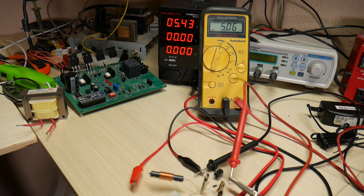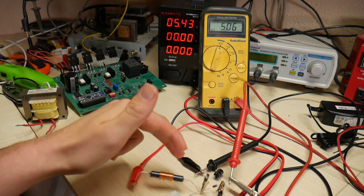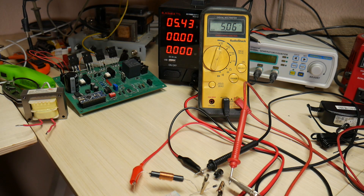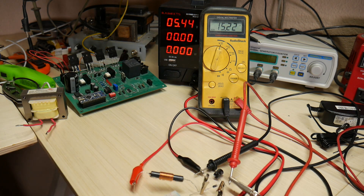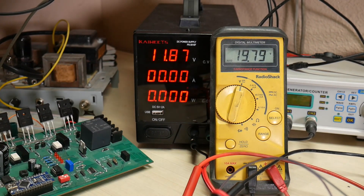Here's a really cool demonstration of my boost converter working. I've got an inductor, capacitor, and diode wired the same way as in my circuit, but instead of a MOSFET transistor I'm just going to be shorting it with a simple wire. On my multimeter I have 5.06 volts, and on my power supply I've got 5.43 volts — the voltage drop is just because of the diode. Now watch what happens when I short ground to the end of this inductor — 9 volts, 12 volts, 13, 14, 15.28 volts! That's crazy. So we're just boosting the voltage by shorting the wire. If I was actually using a transistor at a certain frequency and duty cycle, I'd probably get that voltage a lot higher and a lot faster. But that's a really cool proof of concept for how a boost converter works.